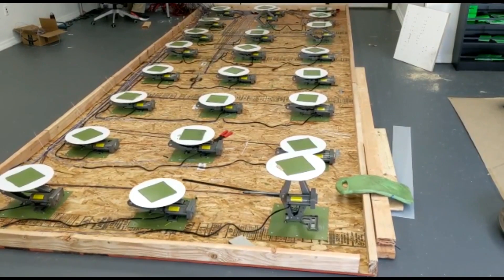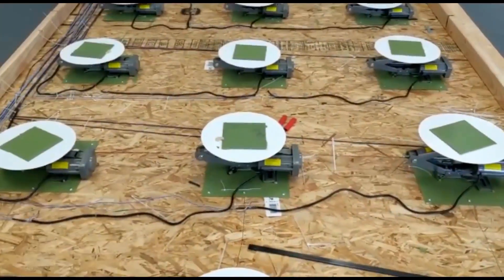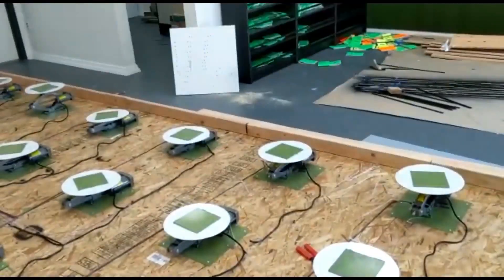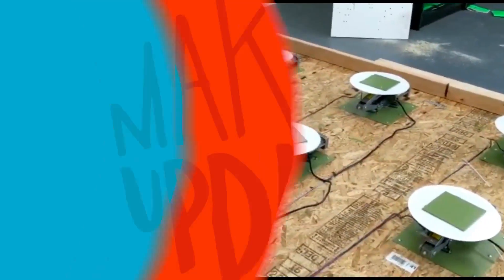What's interesting here is that he's using the ultrasonic sensors to measure the height of each jack. That way he can send out a command for the jack to rise until it reaches a specific height, measured underneath the floor by the ultrasonic sensor, and then reported back.